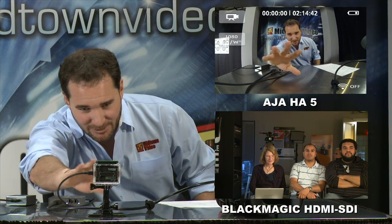HDMI out of the PMW200, HDMI out of the GoPro. What we have here are two HDMI to SDI converters. That's because my TriCaster 8000, although it does a million things, it does not accept HDMI as an input — same with your TriCaster 455, 8000, 855, and Panasonic cameras. Panasonic makes some excellent switchers too. Everybody out there makes HD-SDI switchers, and those are the switchers you ought to be using, but they're not compatible with these GoPros because GoPros put out an HDMI signal.